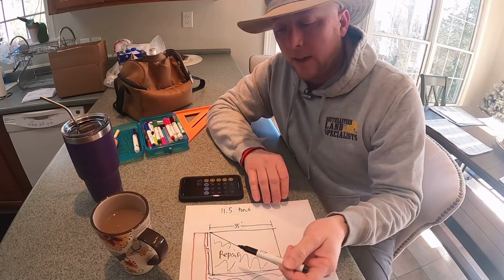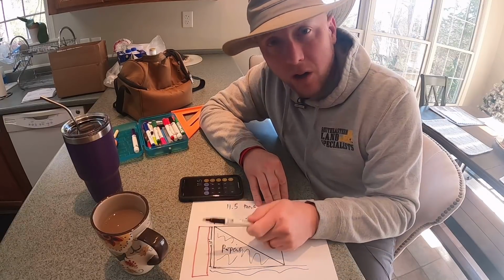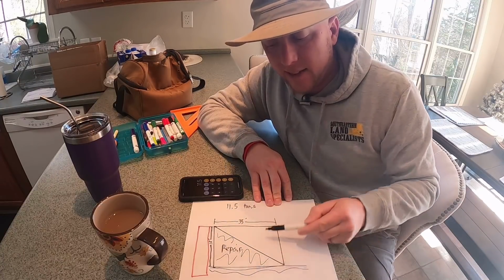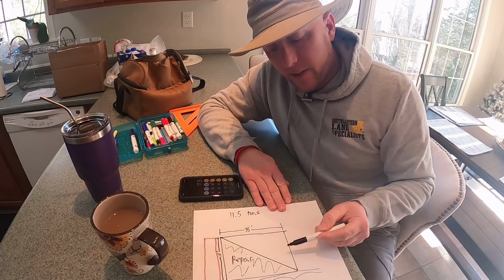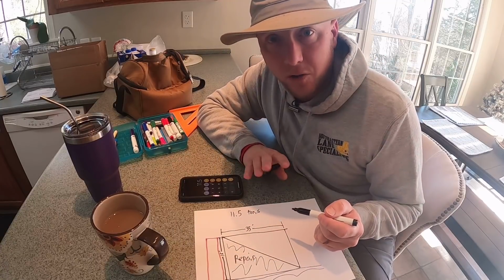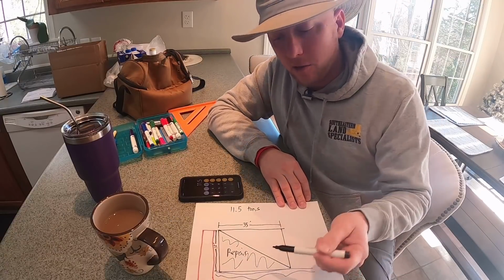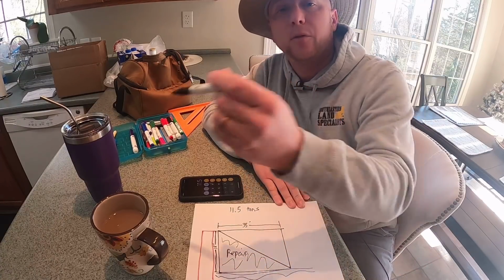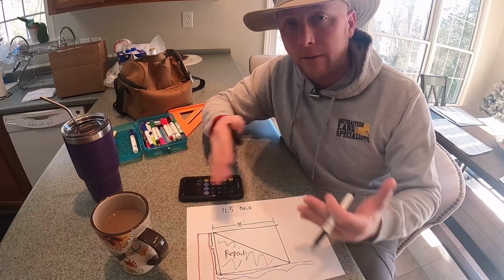Just a quick side note, if the repair area on the other side, the inflow side of the box culvert, was the same, you wouldn't cut this in half. You would just figure a repair area just like this, because this half of the rectangle will be the cost to repair this side, and then when you cut it in half, you got the same price to fix the other side of this box culvert. But the measurements are not the same, so we'll continue on quoting this side, and then you'll be able to apply these same principles and this same kind of drawing to figuring for the other side, which I'll figure for me on this project so you guys can see the difference in expense.